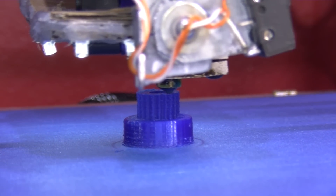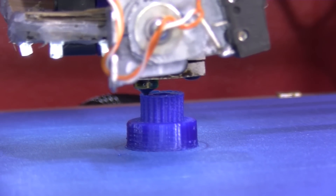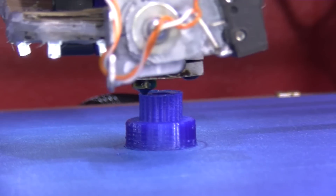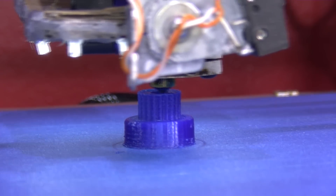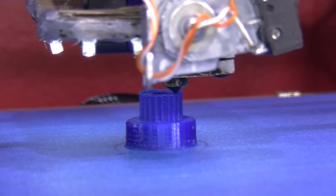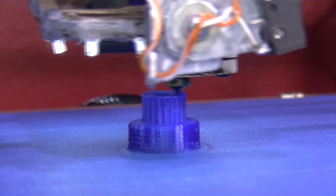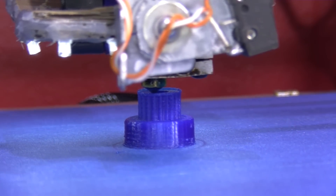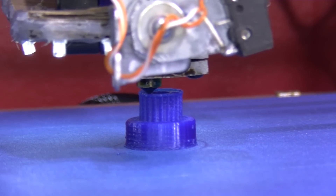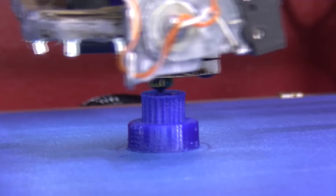By the display it's been 1 hour 12 minutes — it's about 1:16pm here in the UK. It's getting to the very top now, so it should be doing a bit of an end piece — there's sort of an overhang to make sure the belt won't slip off the edge, because it is a belt drive system. It's stuck on up to now. Mind you, I have known prints get to this stage on Kapton tape and still not stay stuck. The bed temperature is ambient 20 degrees centigrade and the nozzle is 200 degrees centigrade.